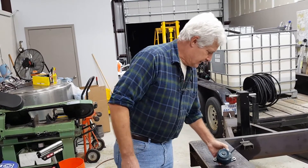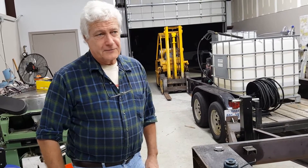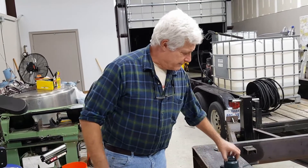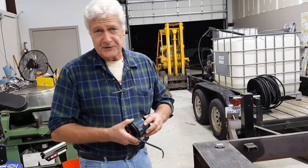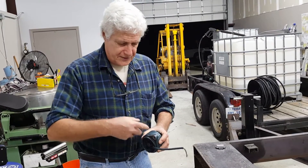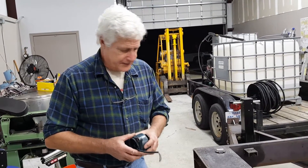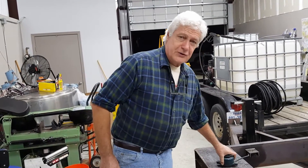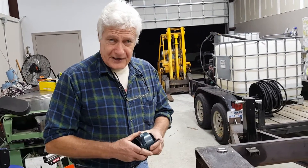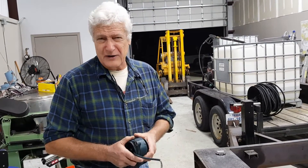What we had to do was get a different type of alternator, actually one for a Yanmar — an aftermarket type of alternator. The construction is very similar: the rotor contains permanent magnets, and it has a stator where the copper windings are, where the electricity is actually generated. We replaced the original alternator with one produced for a Yanmar, similar in design but with a capacity of about 25 amps.